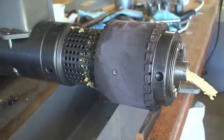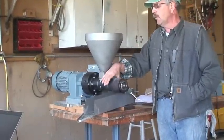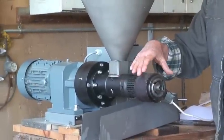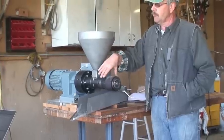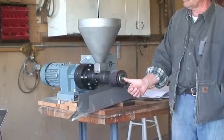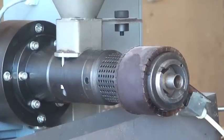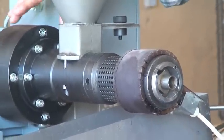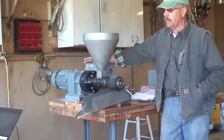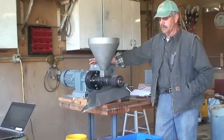This is our oil press, purchased from Circle Energy out in Wisconsin. The purchase cost was right around $6,000. We have a feed hopper, a sieve barrel, and a worm gear inside that drives the meal against the press head. There are four weep channels that come back to the sieve head, and ports for different meal sizes that can also slow down or speed up the rate of meal flow. The machine has a lot of settings and we can adjust worm speed very easily and quickly.